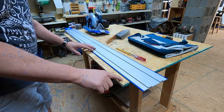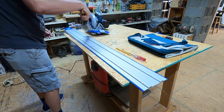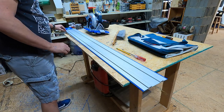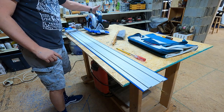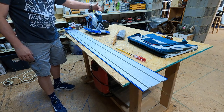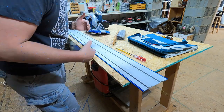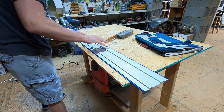Now what we're going to do is use this line that I made originally. I'm going to drop down the saw blade. What I had to do was make my initial straight cut so I know exactly what this saw should be cutting on without any kind of twisting. This is going to be the test to see if it actually cuts perfectly straight along this line. The other thing I like about this saw is it doesn't have a safety button — it's just pull the trigger and you're good to go. You don't have to worry about using your thumb or whatever. This is a really, really nice saw, guys. If you're interested, I would spend the money and get a really good circular saw opposed to going like I did and getting a cheap crap saw. Don't do it. We should be lined up — let's double check one more time. Yep, we're good. Let's get this thing cut.